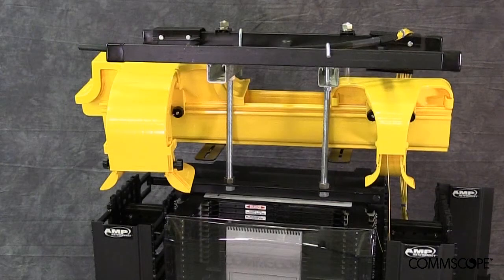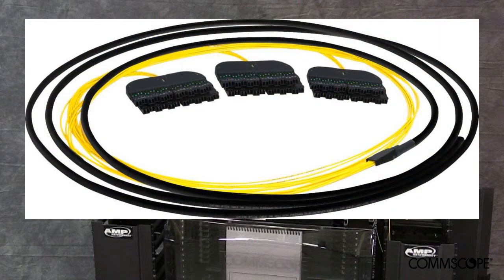To perform the entire installation demonstrated in this video, the required CommScope parts to order are as follows. First, the pre-terminated 432-fiber NG4 CMOD cable assembly. This indoor-outdoor rated ribbon fiber cable has an outside diameter of 0.9 inch and is available in lengths up to 1,000 feet. In early 2018, CommScope will release an 864-fiber rollable ribbon version of this cable with an outside diameter of 0.77 inch.